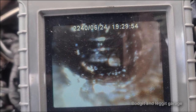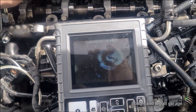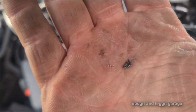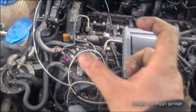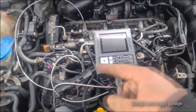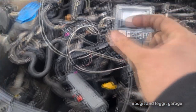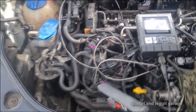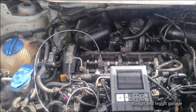I've got to figure out how to get that out and I really don't know yet. The hole is all the way down and it's ready for tapping and putting the inserts in. You wouldn't believe how I got all those bits out. I got a long, thin Allen key, coiled wire around it, put it on my battery in the van and sparked it — I actually magnetized the Allen key, because the magnet I had was way too big to go down the hole. I managed to get all the little bits out using a 12-volt battery, coiled wire, and a piece of metal. You have to think outside the box sometimes.